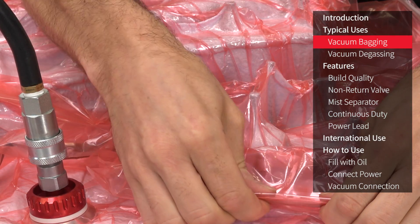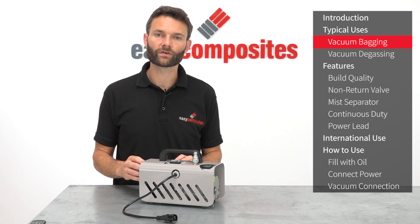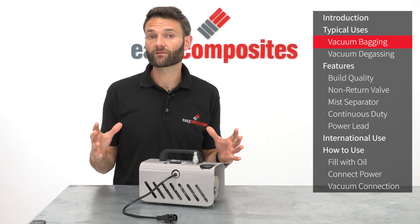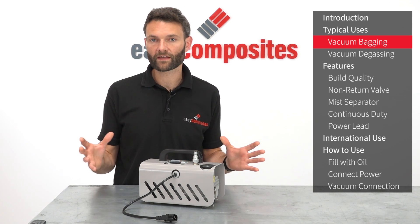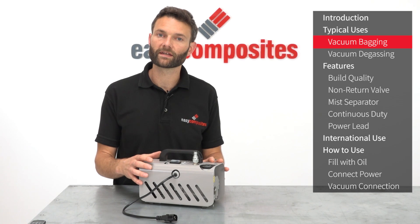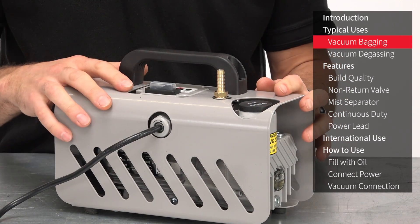The only difference will be the time it takes to empty the bag in the first place. With much larger vacuum bagging projects such as the size of a full-scale boat hull, it starts to become quite impractical to ensure that you've got a perfectly sealed bag, and so inevitably on projects of that size the vacuum pump is always pulling against a leak. At that scale it would be advantageous to have a larger vacuum pump such as our EC20, which can easily overcome those leaks — but that's really the only situation where a larger pump than the EC4 would be required for most vacuum bagging applications.